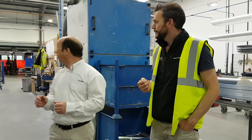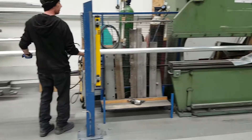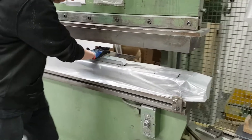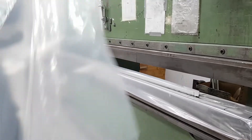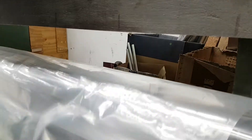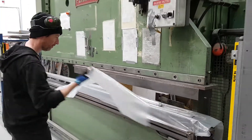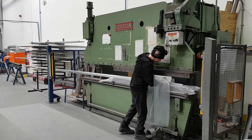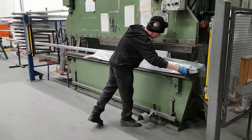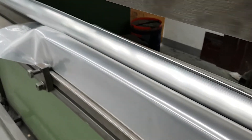We've cut the slot out of the front and now we need to move to the press to start making the taper. The section is loaded into the press — there's a different set of tools for each section that we do. The press comes down and squeezes the V that was cut out, rolling the tube over to form it back into a round section. We have to do it three times. It's not a squashing action — if you just squashed it you'd end up with a mast that looked like a pancake. We have special tooling to keep the track dimension the same while the section is rolled round.